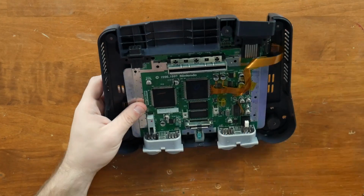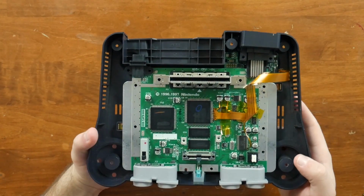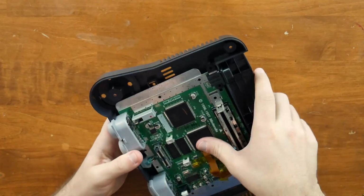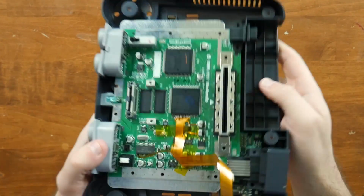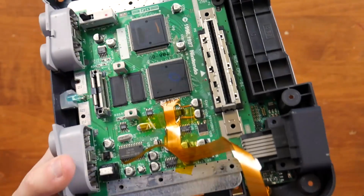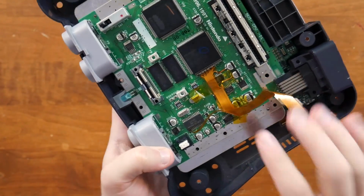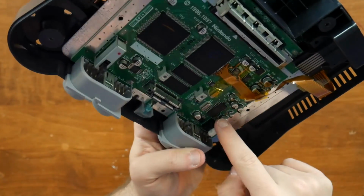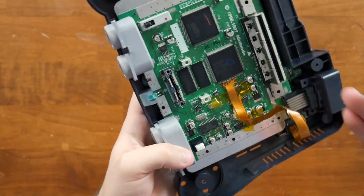And you can see the way this works is you essentially are pulling video directly from the main chip here. This should be the RCP chip. I have to double check to make sure I have that right. But this is your RCP chip right here, and that is where the mod directs you to solder your leads to. They give you all of this, the cable that's all set up specially to work, that also pulls power from our capacitors here, and then it has another cable that runs down to the bottom here that will solder in 2 different spots depending on your model.